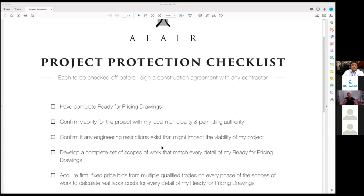Now, if you're far below that, we've had situations where we've done additions to homes and we've lowered the basement in the addition, but we kept the original staircase. We had to get a special exception to walk from the stairs to the addition because that was 6'6" or something thereabouts. And we couldn't do any remodeling work in that area, but only in the addition.